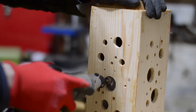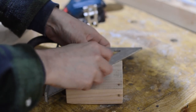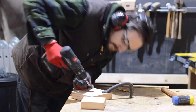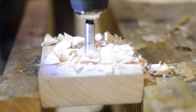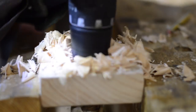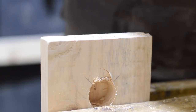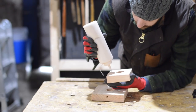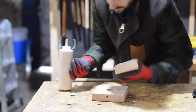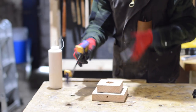This is a knock-off Dremel tool I've got, and I never use it — I forgot I had it, but for this it was ideal. The base is going to need a hole in it for the cable to go through, so I mark out where the centre is. Off camera, I've cut another piece of wood about one inch bigger than the base. I then drill through the base all the way, and into the bit that's a little bigger I drill halfway through. Then the bigger piece that I've drilled halfway through, I can drill through the side going down into the hole I've drilled. Basically, the cable's going to go in the side, up through the hole, and up through the base. So that smaller bit of wood actually fits inside the box — or the box slides over it — and then sits on the bigger bit of wood at the bottom. I've got a few clamps on it, and then they can just be left to dry.